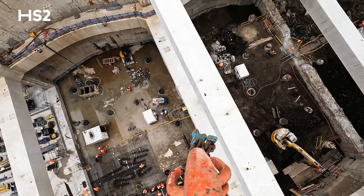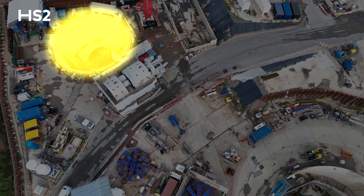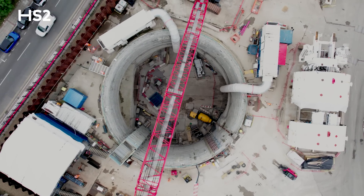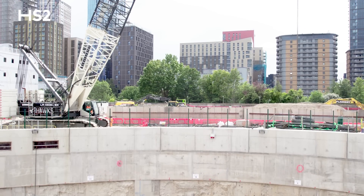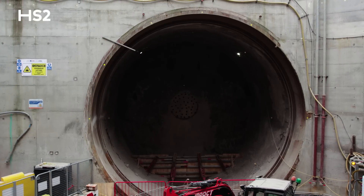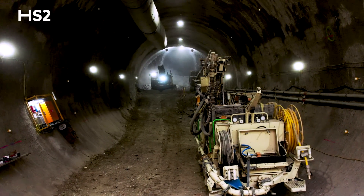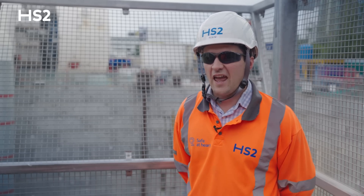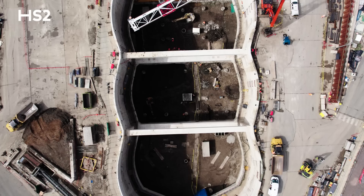After gaining strength, the TBMs will mobilise into the box and they're ready to cut the tunnel eye. We're now at the Victoria Road ancillary shaft, which is on the same site as the box but over in the far corner. The shaft is 25 metres in diameter and 25 metres deep. It was constructed using a more common method with segments for the first 11 metres and then spray concrete lining down to the base. After completing that we constructed the secondary lining and a 1,000 cubic metre base slab, then handed the shaft over to our internal SCL team who are constructing the tunnels from here back to the crossover box. Once their works are complete, we will take over the shaft and construct a reinforced concrete core and a head house, which will provide escape and access into the running tunnels and also provide services and signalling down to the track.